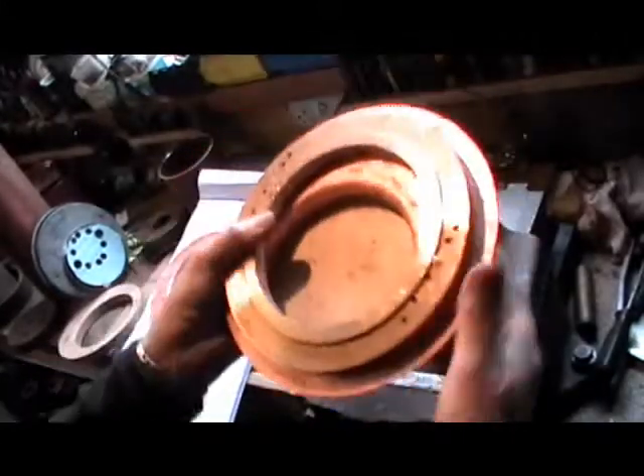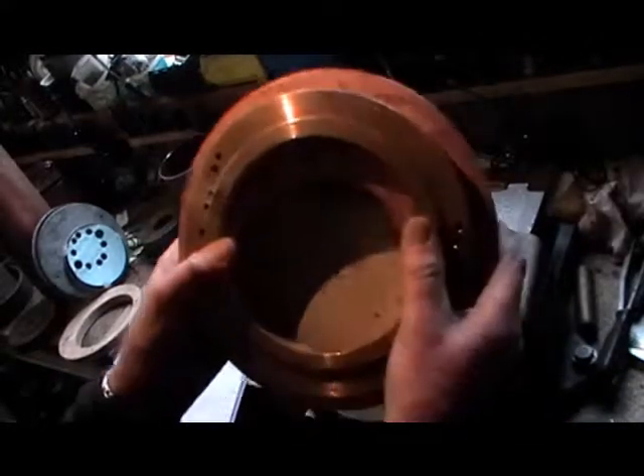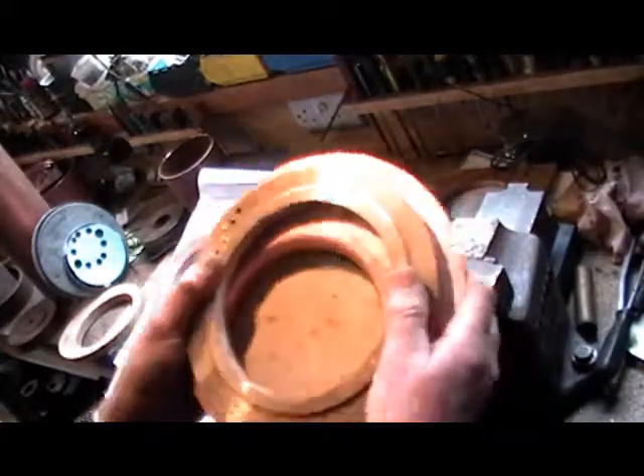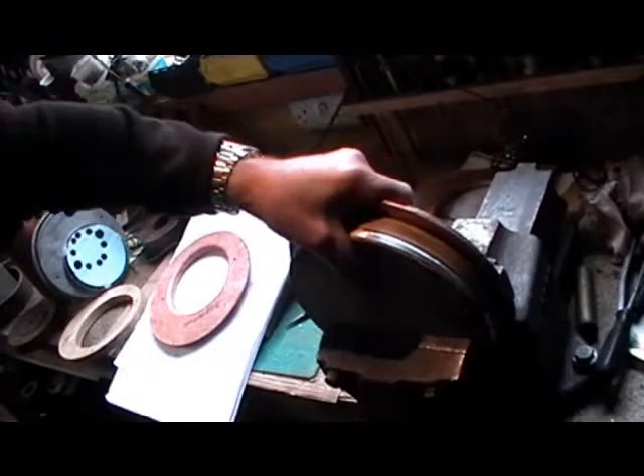It's the same procedure: anneal it, do a bit of flanging, anneal it, and so on until you've got that flange perfectly formed. Just to clarify what I've done: I've moved the locating pegs down to the half inch above the centre mark for the back head position on my former, put the former on my copper so the outer edge is concentric, put my spacer board in between to protect the inner flange, and put a metal plate on the back of that piece of wood to strengthen it because it's very thin at the bottom. Now it's ready for clamping in the vice to form the outer flange.